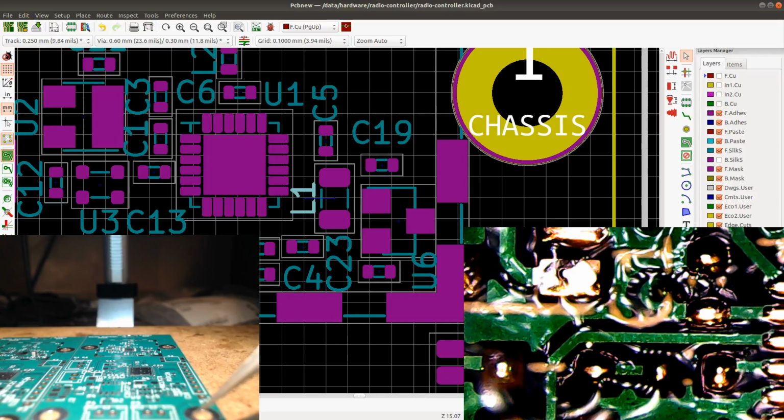So 0603, 16 volt, 10 microfarad. Where's that gonna go? Got 4 of them. Let's see. 10 microfarad, 16 volts. Where's that gonna go? There. So we got 4 of them, and we have 2 per board. So C25 and C28. Let's see where C25 and C28 are. So I can see C25 right there, and C27, C29, C28 there. I can see both of them right away, in terms of designators, on this board. C28 right there, so we can start with that one. Let's see.